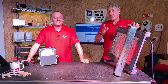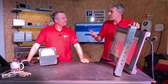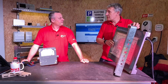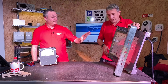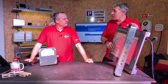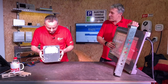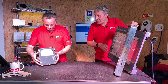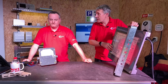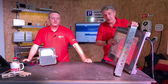It's a huge design advantage, and remember wasted light is also wasted energy. That distribution is a way of saving energy if you correctly design your installation. Obviously that is a very large unit — the XL. What's the power rating? This is a 250 watt unit at 36,000 lumens — pretty bright. The smaller one is 38 watts at 4,200 lumens, for different applications. You're probably looking at general lighting, signage, or landscape lighting for the smaller one, while the XL is for large car parks, sports lighting applications, things like that.